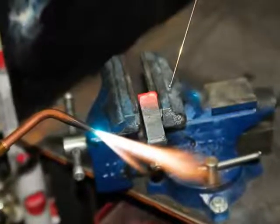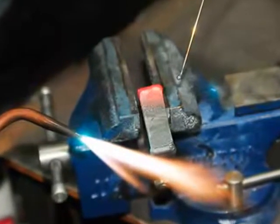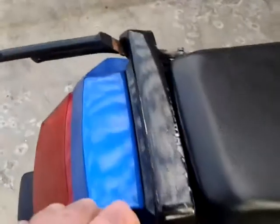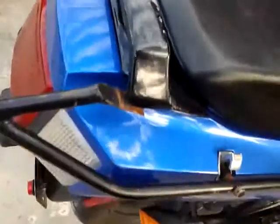The most notable fault was the fact that it was difficult to build because it was welded together, and welding 4130 chromoly steel is not a skill that everyone has. Another problem was that the deck was parallel to the ground, which prevented vehicles in the rear from seeing the brake light if they were too close. And lastly, although chromoly steel is very strong and light, it's prone to fatigue cracking, which caused me to have to re-weld it several times to fix the cracks.